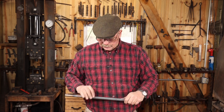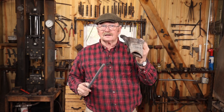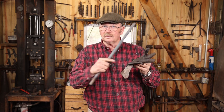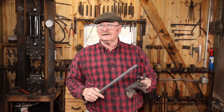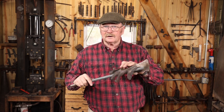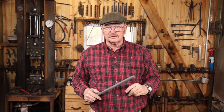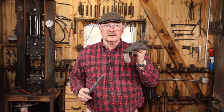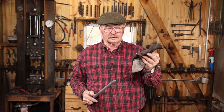Now not all gloves are created equal. Leather gloves heat up and they hold the heat. These synthetic gloves — the problem with them is that they are synthetic. They have rubber palms, really pretty grippy, not too bad for the hammer hand. They don't do hardly anything to block the heat, and they're even harder to get off than the leather gloves. And if that synthetic melts because you grabbed something that was too hot, now you have melted synthetic on your hand. That's going to require a trip to the emergency room, and maybe to see a specialist to get that stuff off your hand. So I really try to avoid these around hot material. Great for working around a grinder — that's the only reason I own them.